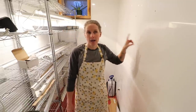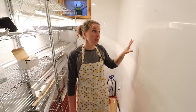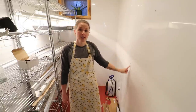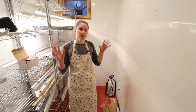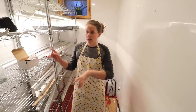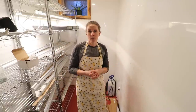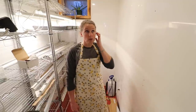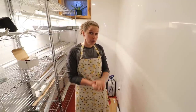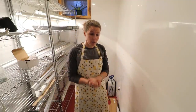This is the same wall board that they use on skating rinks, so it's actually a plastic. I'm not sure what the technical name is for it but I'll ask Dan and put it down in the show notes for you. The reason that we chose this board is because we wanted this room to be watertight, so that the humidity coming off the plants couldn't get into the walls and cause any mold issues. Dan was doing research and this board came up, so we decided to give it a try. I wanted to share something we learned about this board that we did not know before and didn't find online when we were doing research.